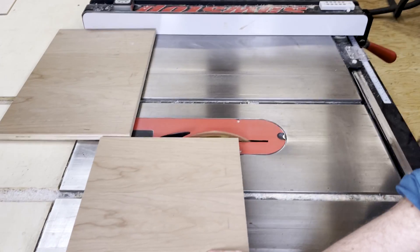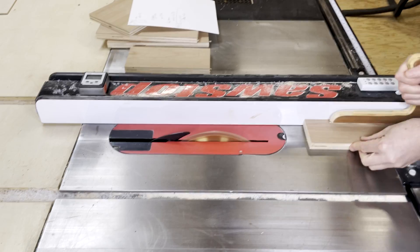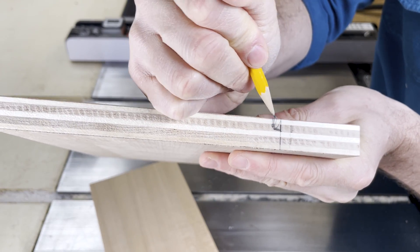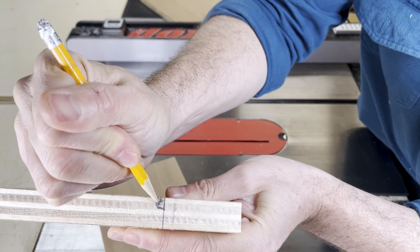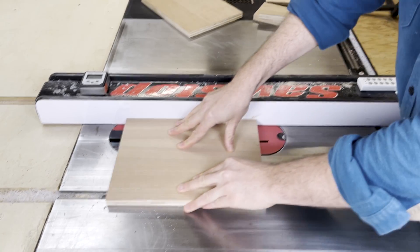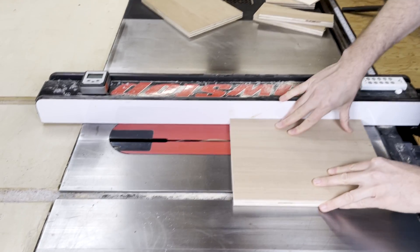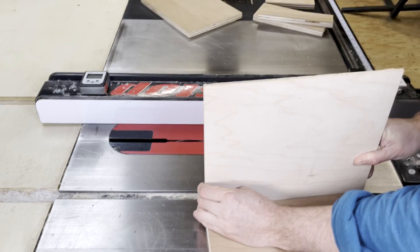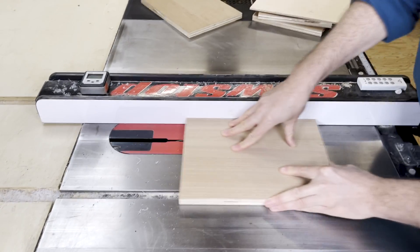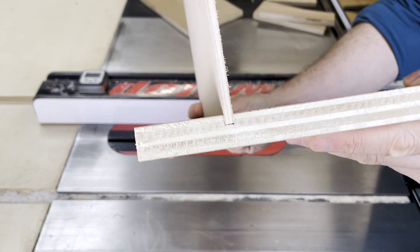The first thing we're going to do is make a plywood box, and to make a plywood box, the first thing you do is cut some plywood rectangles. Next, we're going to cut a couple of slots into the sides of the housing that will accept the dust guard, which will make it a lot easier when it comes time to glue the whole thing up. So we take a cut, then we adjust the fence a tiny bit, we take another cut, test to see if the dust guard fits, adjust a tiny bit, take another cut, and test to get a great fit.